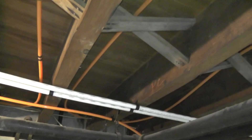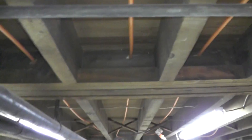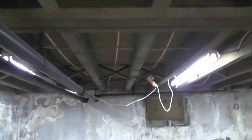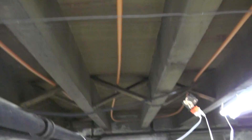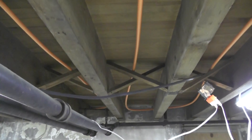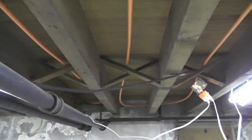What I found was a couple of things. Number one, this really doesn't do anything to heat the floors and the rooms above. I think the main reason it doesn't work is because the PEX is just sitting in the air — it's not making contact with the floor above, which is actually the recommended way to install it. The second thing is I only have one length of PEX per bay, and it's also recommended that you use two runs per bay and run them in a crossover loop style.